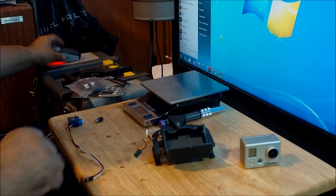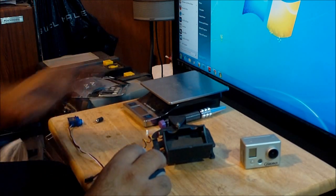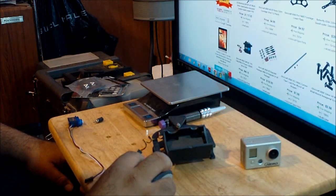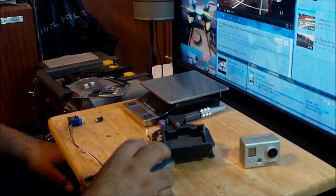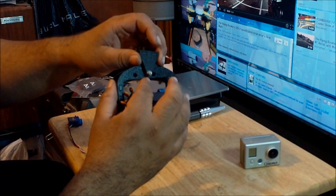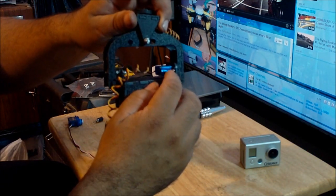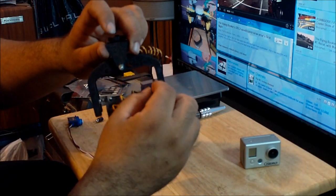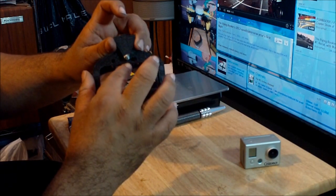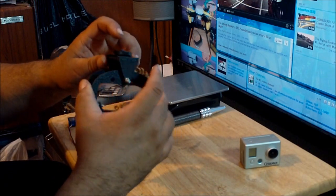One thing that I didn't like about this product was that the axes have no ball bearing support like most camera mounts on the market. For example, on the top over here, it was using a really tiny screw, like the one you would use to secure servos into the camera mount. It's like a 1.5 millimeter self-tapping screw. And it didn't come with a hole to mount where the screw goes, so you have to kind of figure out where the hole goes.